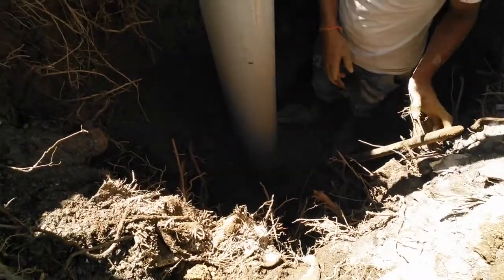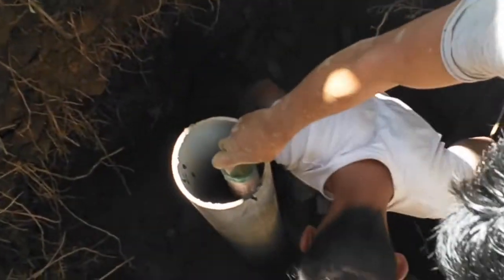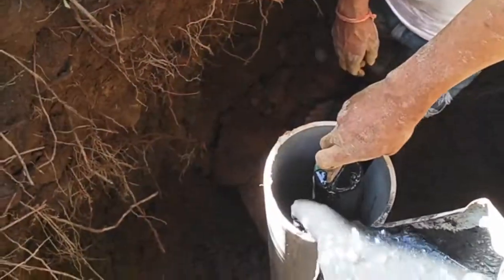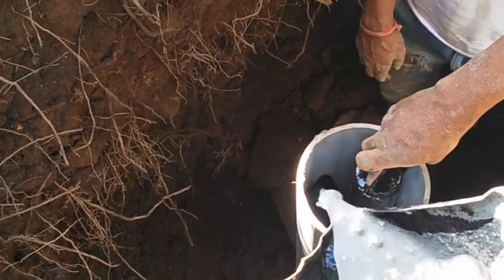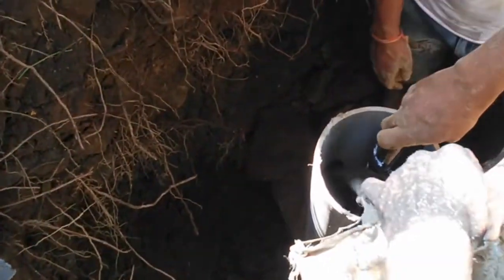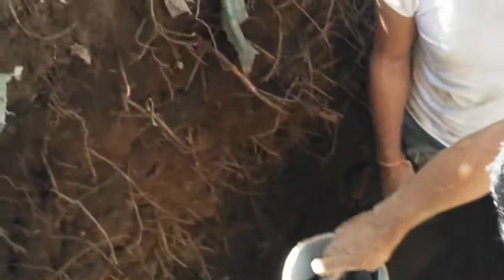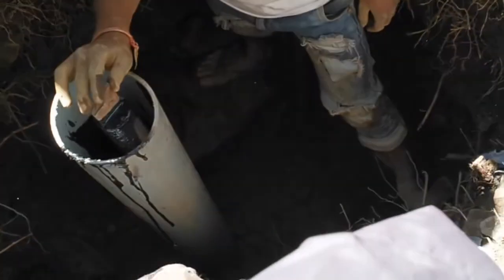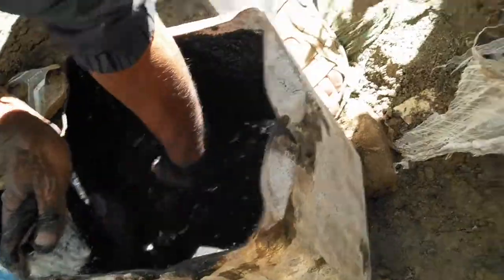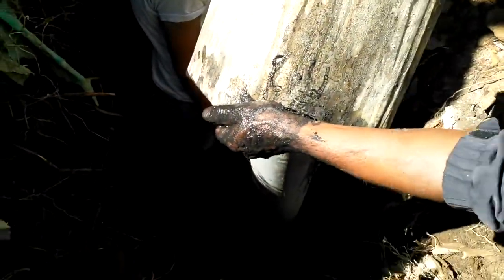Making sure that the soil is tight in and around, and also making sure that the pipe comes out gradually. We have prepared another mix of water and backfill compound, filling up the pipe surrounding the electrode. Since one 25 kg bag of backfill compound was not enough to fill the entire 2 meter pipe, another 25 kg was required — so a total of 50 kg backfill compound was needed to fill the pipe to 2 meter height.